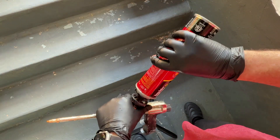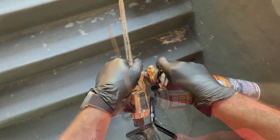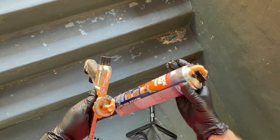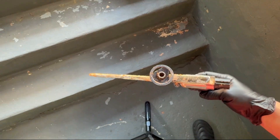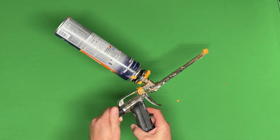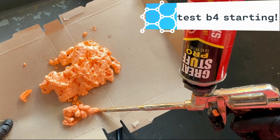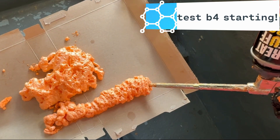Loading and unloading is pretty easy. You don't need to twist it on too tight. And if you do maintain a clean tool, especially around the connection point, it's not going to be an issue to spin these bottles on and off as many times as you need to. The little black dial on the back end of the foam gun controls the flow of the foam to some degree. The trigger also has a lot to do with it. It's hard really to put into words exactly how to get a feel for it, but once you go around your attic or your basement, it won't take too many attempts to start to get a feel for things.